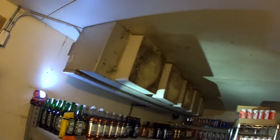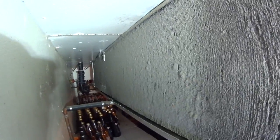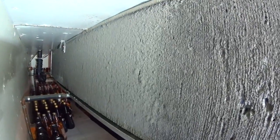I wanted to show you something — this goes on for years. A lot of boxes and coolers, the owners are looking at the front every day, but if you walk back here and look at this evaporator coil, it's completely fluffed up. It's just acting like a big filter back here, and all the way down it's like that — it's just amazing.